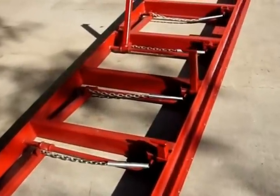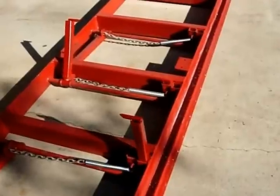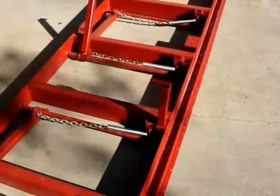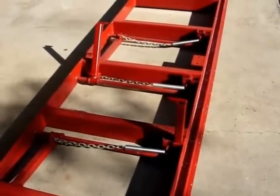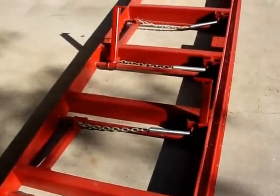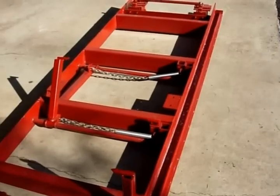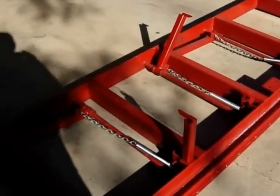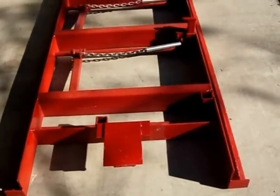The sawdog mechanism is the same as my first saw. I have varying lengths on the static end, and then on the other end this is just 3/4 inch pipe with 1 inch T's on it. You tap them with a sledgehammer, and then the chain and spring hold them together and they bite into the log - they'll hold a hardwood really well. Like mesquite needs to be really solid. Your steel service center can cut your parts, which they did for me, and I just welded it together.